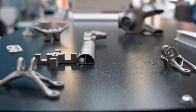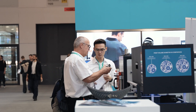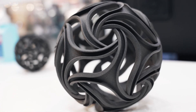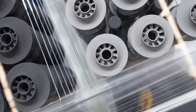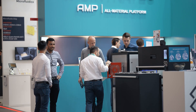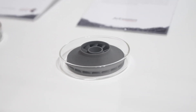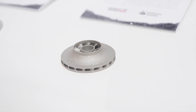There's one more thing — we're also bringing metal into the mix. The all-material platform is in our opinion the new era for SLS, because you can produce polymer and metal parts in the same system. It's called cold metal fusion. Together with leading sintering industry players we have joined in an alliance to bring this technology to the all-material platform. It works like this: you have a material composed of metal and polymer, you make a so-called green part in our Fusion modules, they go into a debinder and then into a furnace, and out you get your metal parts.